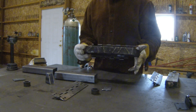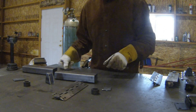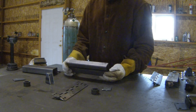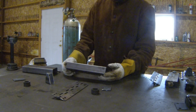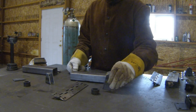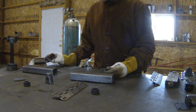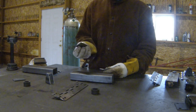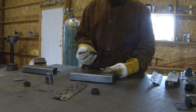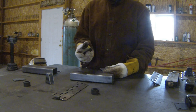On the Leopard pads, I took a piece of rectangular tubing, inch and a half by two and a half, 0.083 wall, and I cut it to 8 and 5/8 inches. We'll weld the ends on, which are a piece of flat bar, inch and a half wide, 3/16 thick, cut to two and seven-sixteenths inches long.